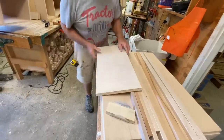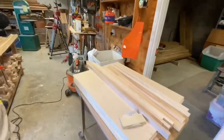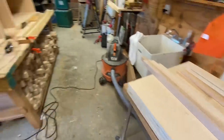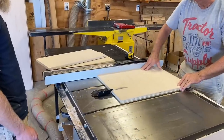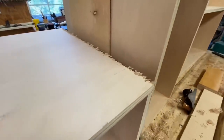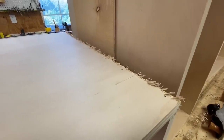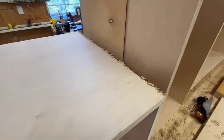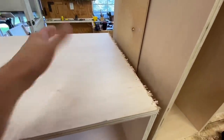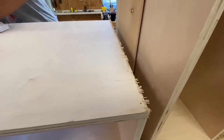That's what we call fine cutting there. Yeah, that's nice. So what he was doing just now is raking off all the splinters because the edge of the plywood tears out really bad on my table saw. Actually, I'm gonna show you one that's really bad. Oh my goodness. Woodworker friends, I'm really sorry. I'm gonna put this on video. Hey, look at that. Do you like that? It looks like it came fresh off the sawmill to me. But actually what we're doing here is putting all of these bad edges in a place where they're not gonna be visible. We're lucky in this case that we have that opportunity that we can hide all this.